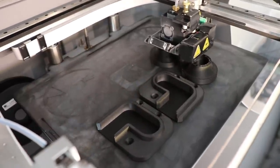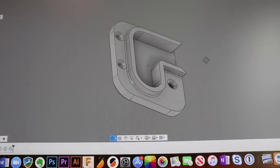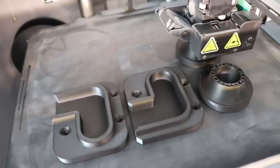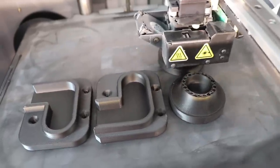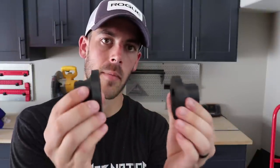For mounting the paper towel holder below, I chose to use some 3D printed parts. If you don't have a 3D printer, you could easily make this out of wood or other materials. For the cradles on each side that hold the dowel — which in turn holds the paper towels — I modeled up mirror image parts in Fusion 360 and 3D printed them on my Mark Forged 3D printer. The dowel enters and falls into the slot so it won't come out as you're pulling paper towels. I also had to print some spacers to fit the paper towel roll within the cabinet dimensions.